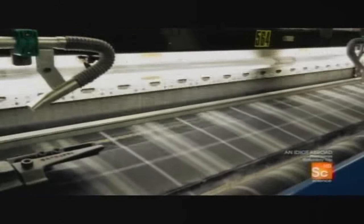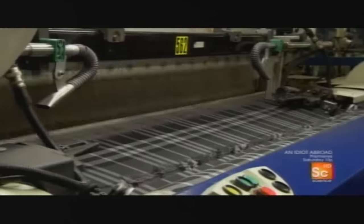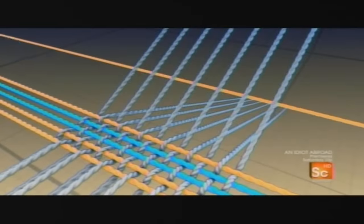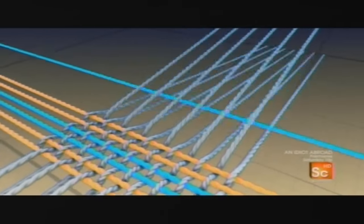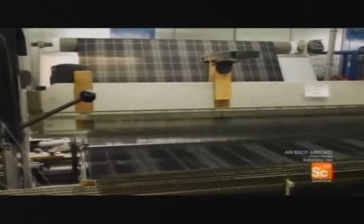But how does the loom create different patterns and textures? A geometric pattern like plaid begins by loading the warp with rows of different colored thread. Sending dark and light colored threads through the rows, the loom can create almost any pattern. The trick is switching between colors. For that, the loom needs a weft presenter, which is a component that selects colors from different bobbins and gives them to the rapiers while they work.